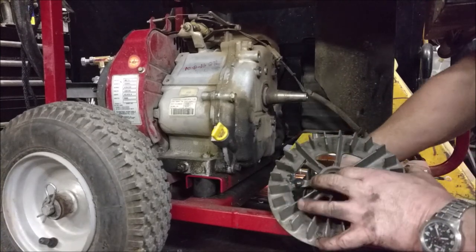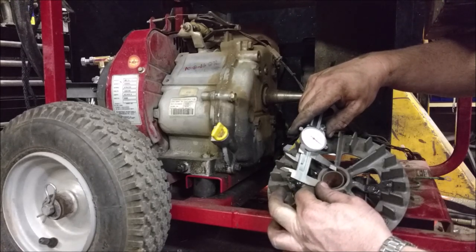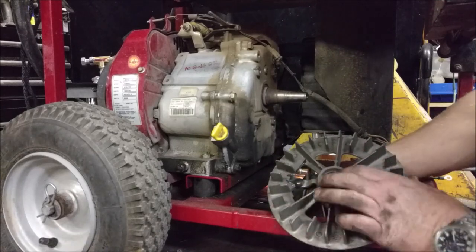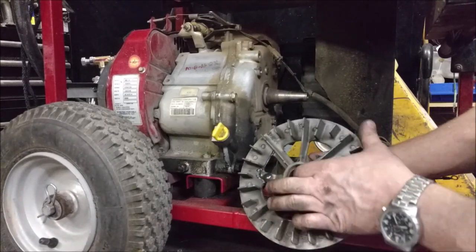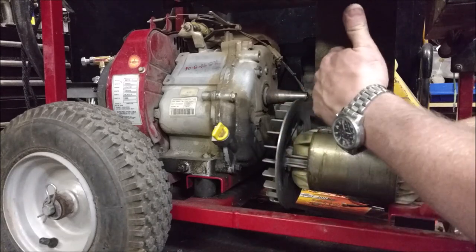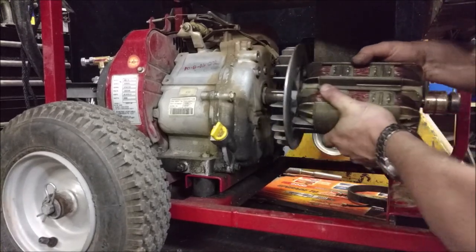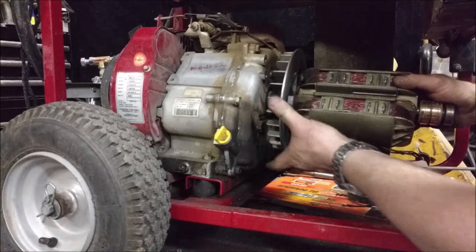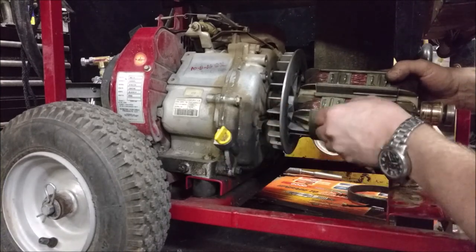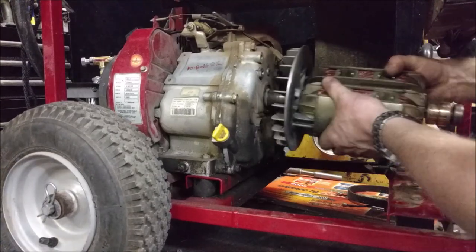A third option is to take the shaft out of your old rotor. This one measures not quite an inch and a quarter — an oddball size — but it has the correct taper inside. You could shim it up to about an inch and an eighth. Just chop this off, grind everything off including that sleeve, and you'll have something with straight walls that fits over the crankshaft, letting you affix a pulley or similar accessory.